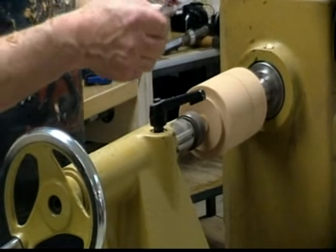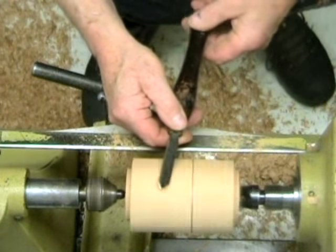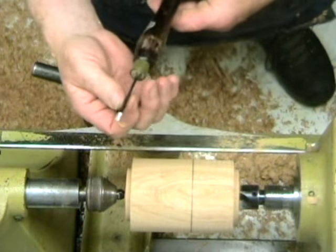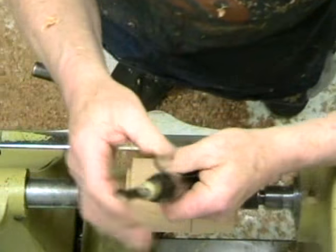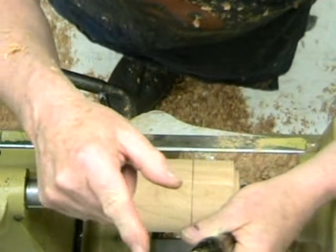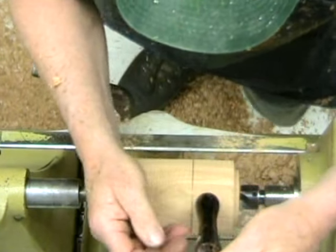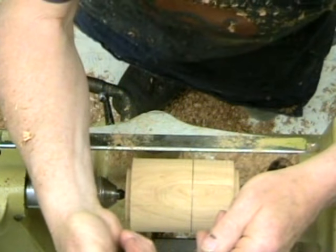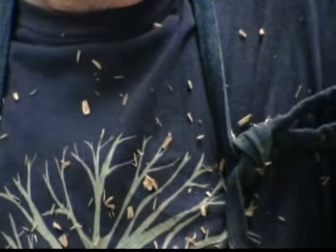And this is a special little tool which you've heard me talk about here before, those of you that have been here before. It's an ordinary 1/8 parting tool, high speed steel. And now, why is one side longer than the other? Pure laziness. See that? One's longer than the other. Just couldn't be bothered keeping them straight. So, now, you know those grooved parting tools you buy and the groove is all the way down the blade? You seen those? Yeah, well, don't buy them. Or if you do, sand the groove off.